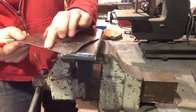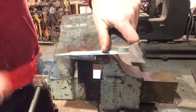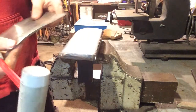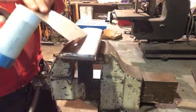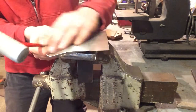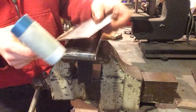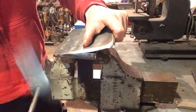So now we've got a nice perimeter here, and you can take that as far as you'd like. Just know that the longer you forge it, the stiffer it's going to be. So generally you want to get your profile shape established before you raise the lip of all of your components. This is just a scrap piece, so we're doing all the test forging to make sure the stake behaves the way we want.